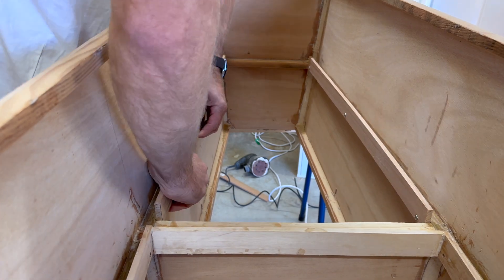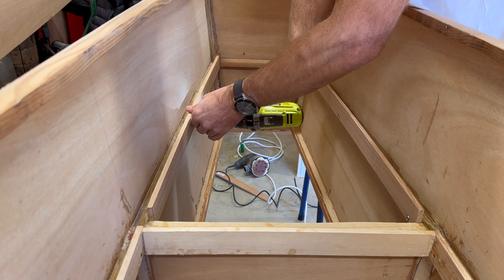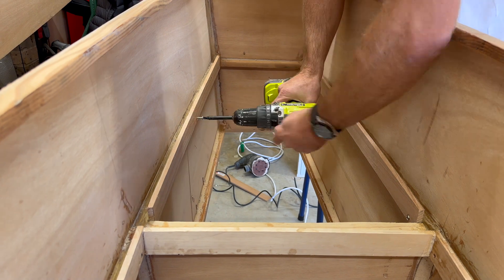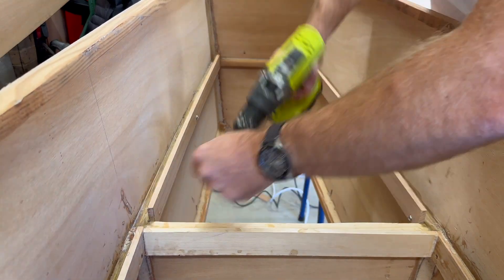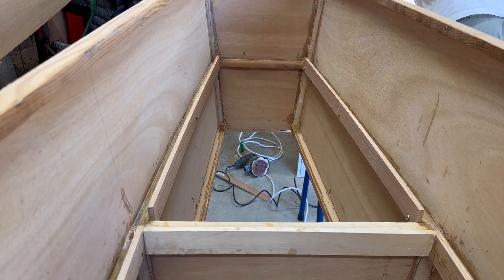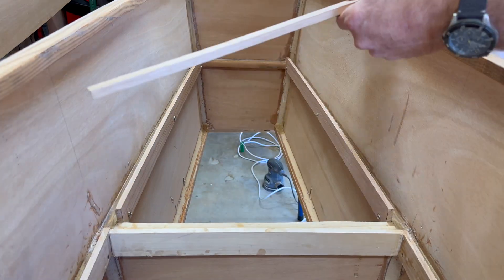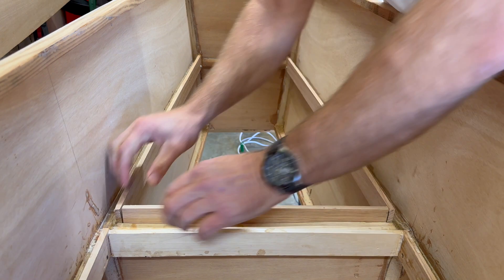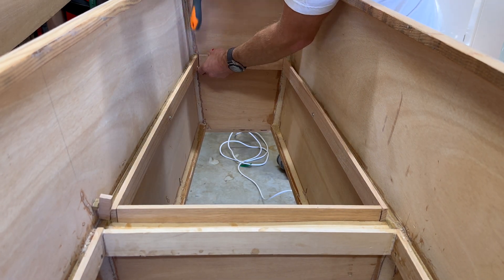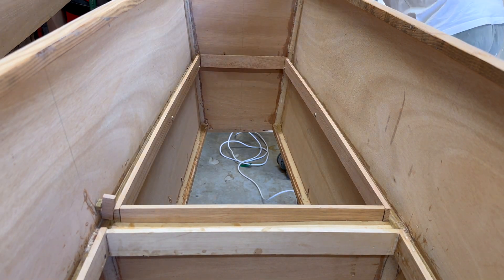The screws won't stay there once the glue has dried — they are purely there for the Tasmanian oak combing strips to hold their shape to the battens, and then they'll be removed once the glue is dried and those holes will be filled. It's a simple repeat on both sides. The front and back faces of the hatch combing are vertical already, so I don't need to use my rasp to straighten them out — it's just a simple case of measure, cut, and fit into shape. I like having them slightly oversized so I can sand down. And that's it — put some epoxy glue in and they're done.